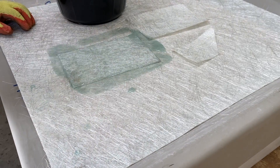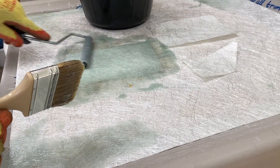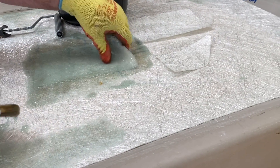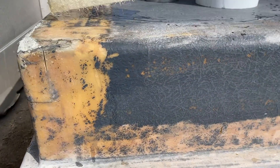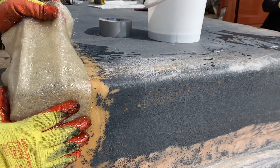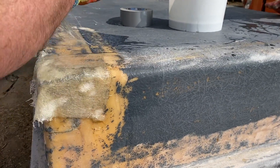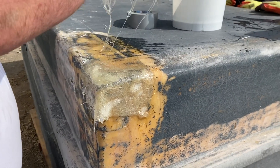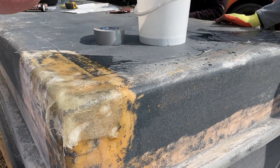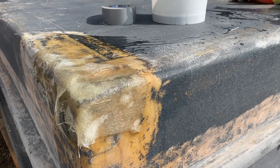When making the repair, saturate sections of glass fibre matting in the catalyzed resin and then consolidate it using a paddle roller or a paintbrush for smaller areas, then transfer it to the damaged section and position them into place over the areas to be repaired. This technique shows a tearing action designed to stretch the laminate over the repaired section. Make sure you're wearing protective gloves — we recommend nitrile gloves and abrasion-resistant gloves when dealing with the glass fibre matting.